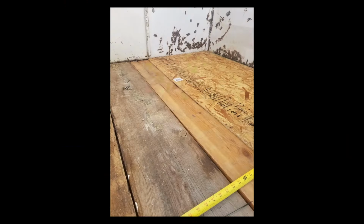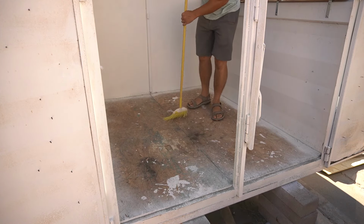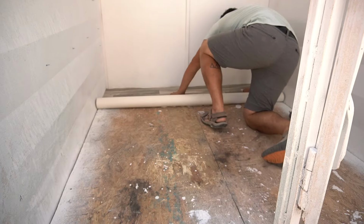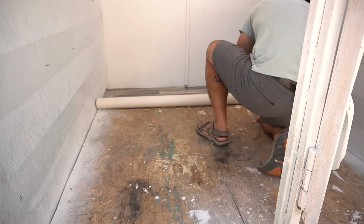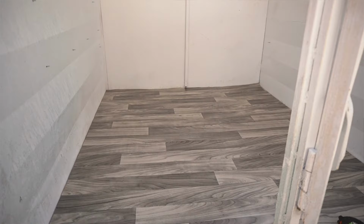I hired a guy from Craigslist, and he helped me. The first thing was just to rip the floors out. So we pulled out the subflooring, pulled out the 2x12s that the floors were made out of, all of that gone. And I replaced it with new 2x12s and used OSB as my subflooring and then a layer of sheet vinyl flooring over that. Then we sanded down the entire thing with angle grinders.